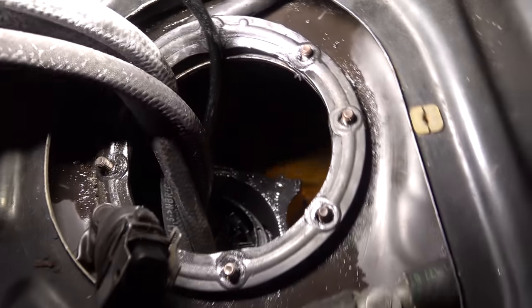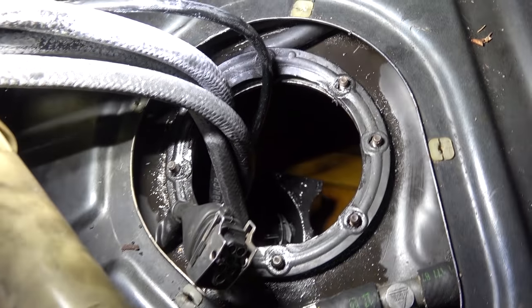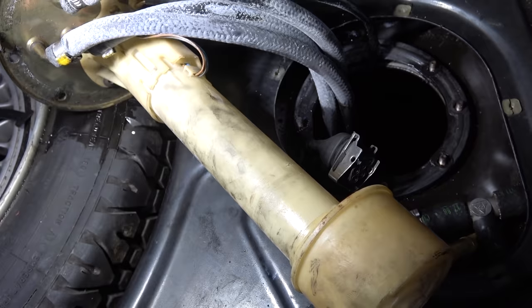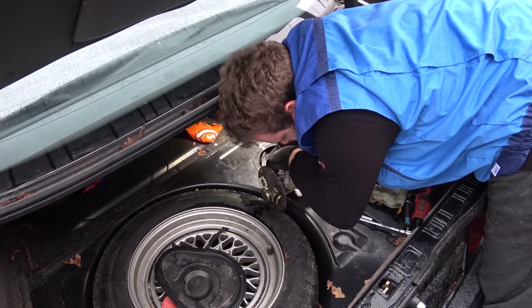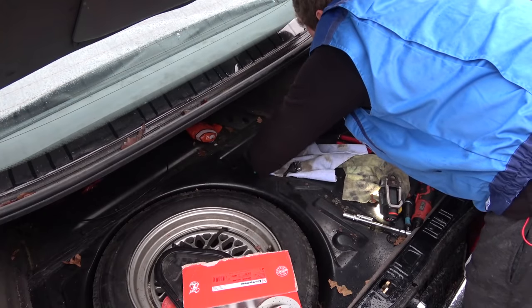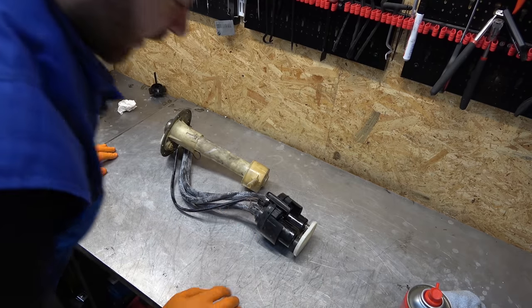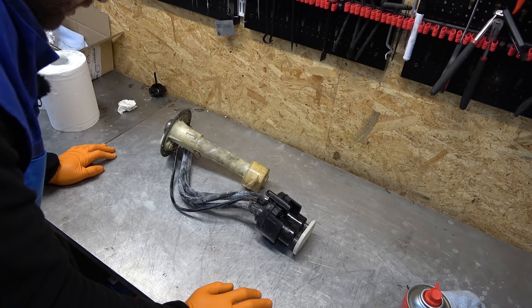This is quite different than the H-series. You can see nasty fuel at the bottom of the tank and the spaghetti of submersible fuel lines — but wait, these are NOT submersible fuel lines. You can see the marking: it says NBR/CR, and it should be CR/CR. NBR/CR is for outside use. So the previous mechanic did not do a good job here — that's why these are super soft.